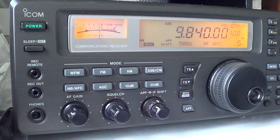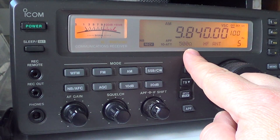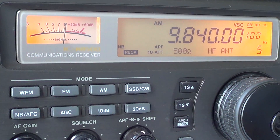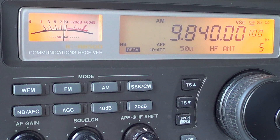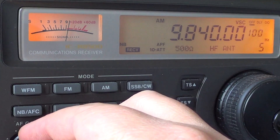Very interesting results. From what I understand, on a lot of signals my long wire is actually quite good and better than my whip — I'm a little surprised. An example I'll show you is 9.840 MHz. There's a signal here and the display is the 500 ohms — this means long wire. Let me switch to the whip — much noisier signal as you see. Back to the long wire. Definitely a winner.